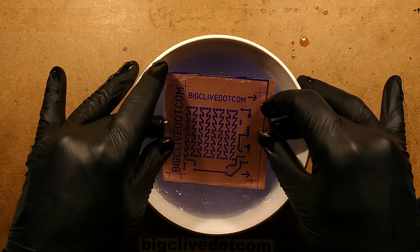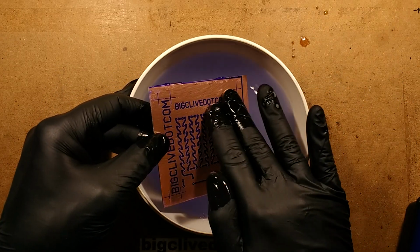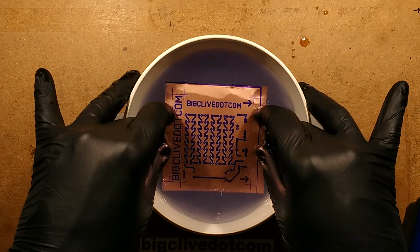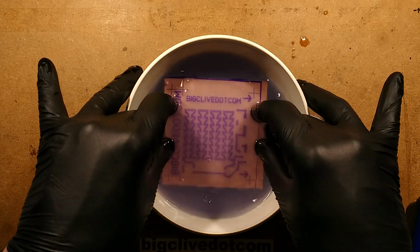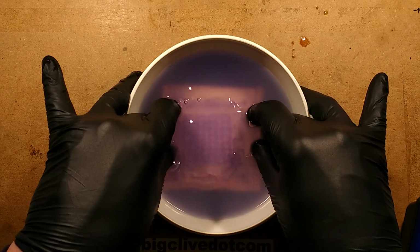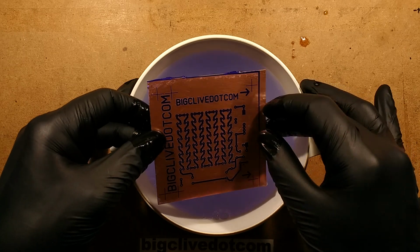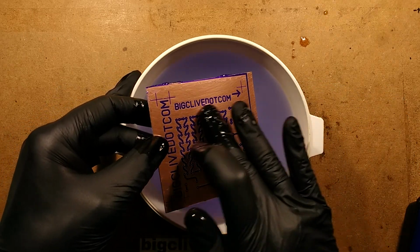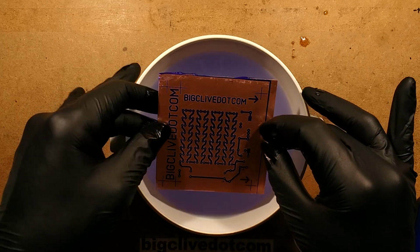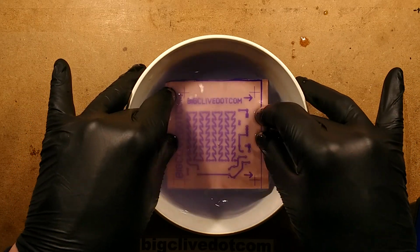When you first experiment with this, I'd recommend not going straight into your first circuit board. Get little snippets of material and experiment with exposure times and different sort of lights. Get a bit of glass to press down on the artwork to make sure it mates to the copper properly. I use an actual ultraviolet exposure unit, which has a foam pad in it that presses things together. And quite nicely, it's got the tubes in the lid of the unit, so you can line all the artwork up and then lower the lid down, and it accurately locks it all in place.